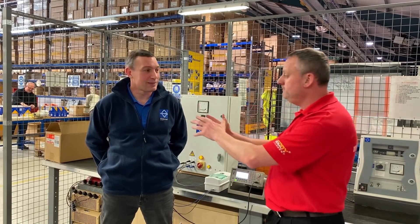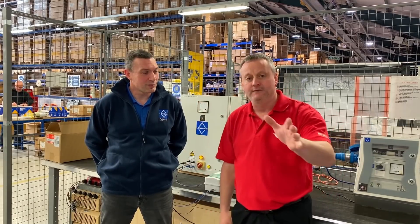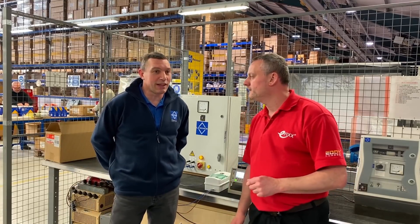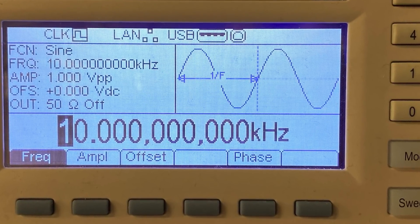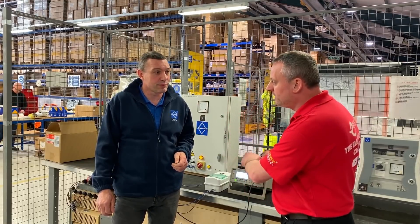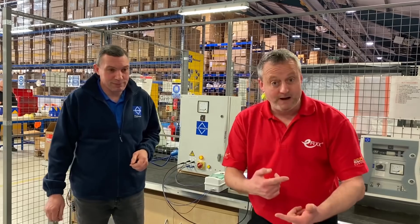At home, when your wife turns on a hairdryer or you rock a light switch back and forth, you can hear that arcing effect — so will the AFDD disconnect under those circumstances? No — what you're seeing in the light switch or in appliances like a hairdryer or portable drill is a natural spark, not an arc. The AFDD is pre-programmed with firmware designed to look for the signatures of those types of devices and ignore them — that's a normal function of the device. It won't trip on a spark that doesn't alter the AC waveform the way a true arc does.